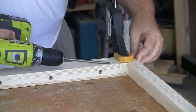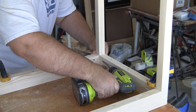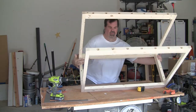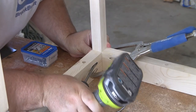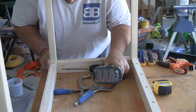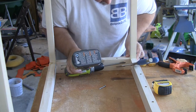With all the holes drilled, plugged, and finally re-drilled, I can finally complete the assembly. Using all the pocket holes I drilled earlier, I screw everything together with 1 1/4 inch coarse grain pocket screws. I'm not using glue, but everything should be plenty strong enough, especially since I'm going to be putting a top, a bottom, as well as a back on this, which should add a ton of strength.